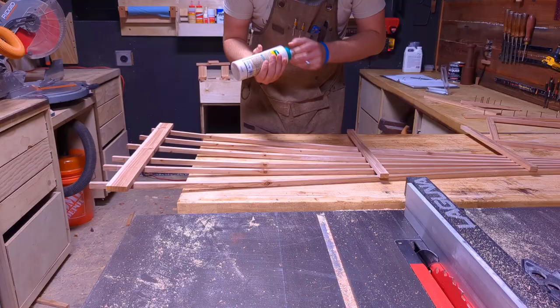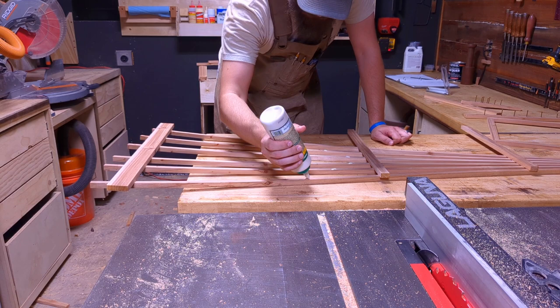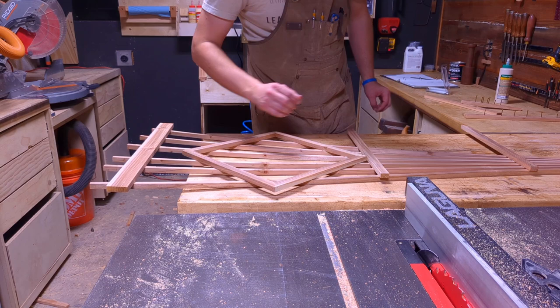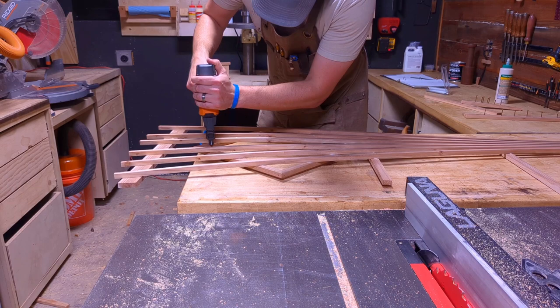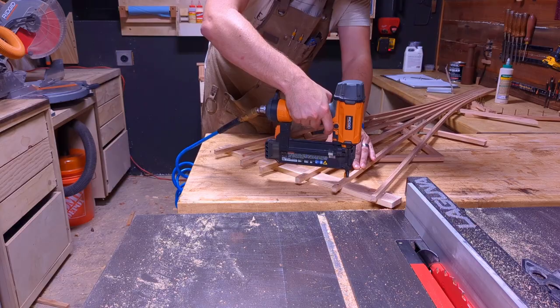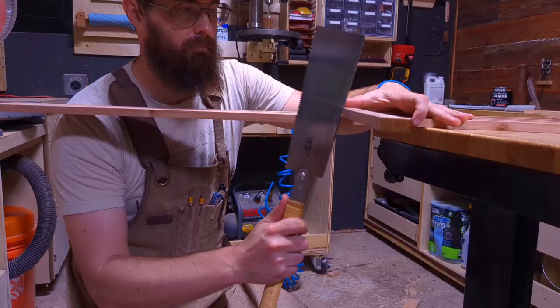Here I'm pre-assembling the little square that goes between the top rung and the middle rung. You just center it as best you can. I find it's best to put it in place, trace the inside lines, take it off, apply glue on the opposite side of the line, and then nail it down. I just centered it until it looked good — there are no specific measurements. Then I come through and nail everything down from the back side.